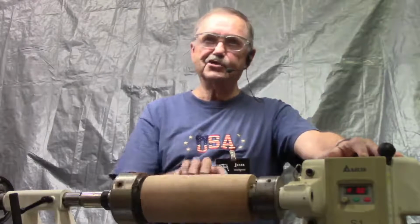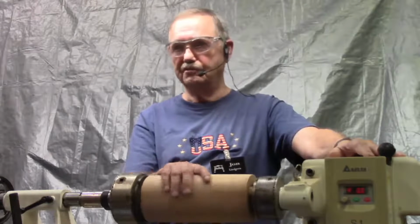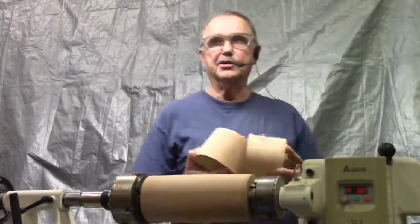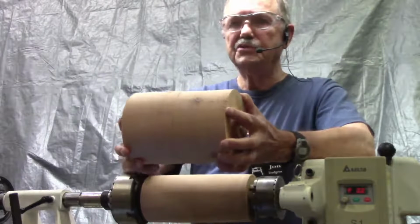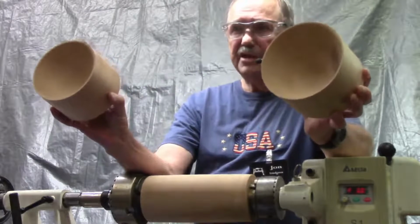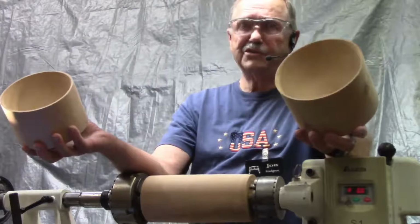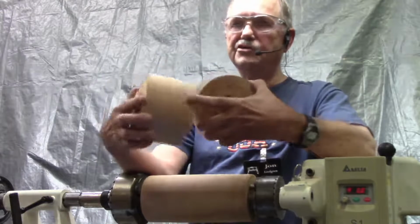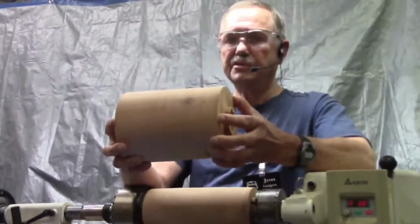I've kind of jokingly said that at show and tell a few times, and everybody goes, eh? But that is exactly what I do: I create the hole in the center of the ball first. So to show you where we're going, I had some cedar laying around my shop from when we did a deck cover, and so I took some pieces of it. This would be the blank, then I parted it, then I turned the inside out. This is where you want to be somewhat precise in turning the inside out, so that you have a nice round hemisphere in there that will match the curvature of the outside of the ball, which will be the diameter of the cylinder that you originally turned.